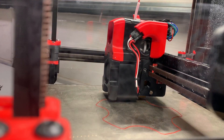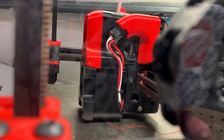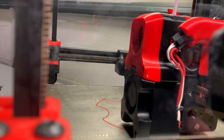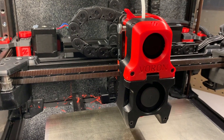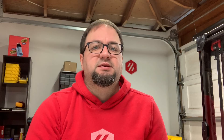The X axis now has two MGN rails, and the main purpose is stability and rigidity. When you toss a NEMA 17 motor on top of the X carriage, you really want this thing to be completely solid. Because of this, there are new XY joints, and I took the opportunity to make them a little more rigid. We are going back to a two-piece design that we used on 2.1, simply because the three-piece design currently used on 2.2 is not quite as rigid as I figured out. You really don't find these things until you strap a heavyweight to your X and throw it around a whole bunch.